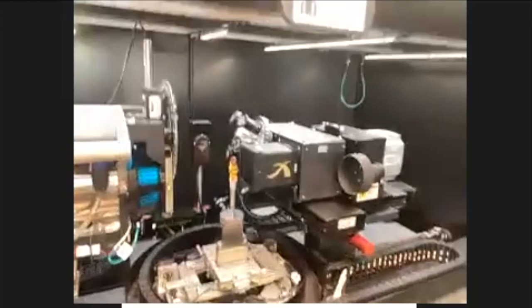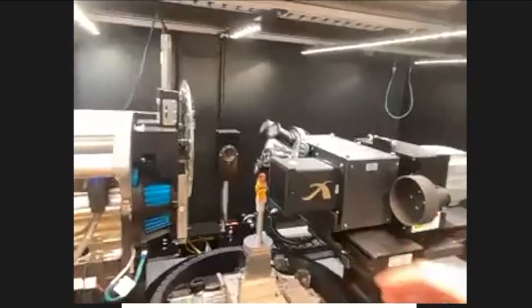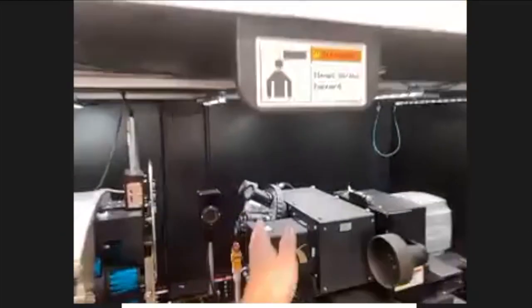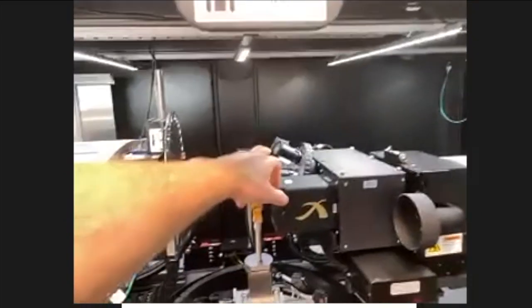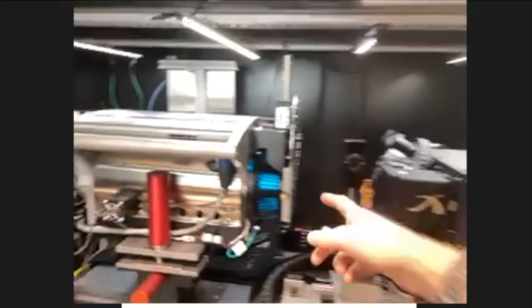I mentioned this is called a 3D X-ray microscope rather than just a simple tomograph. You'll see we have this unit here but also microscope optics behind — we have the possibility, after the scintillator, to magnify the optical image again. So we convert X-ray photons to optical photons and then use normal microscope optics to magnify the image. This allows us to get higher resolution without some of the constraints you'd have in a normal tomograph, which just relies on geometrical divergence.